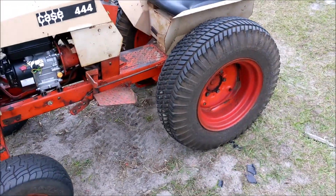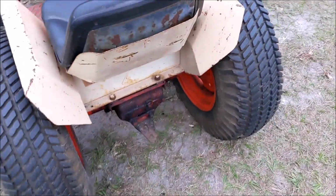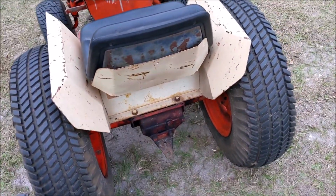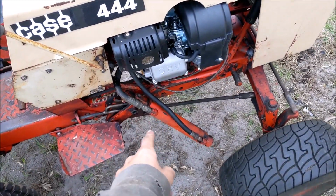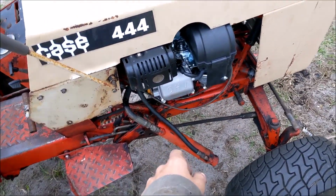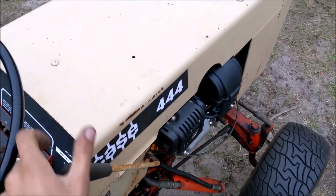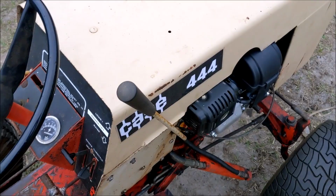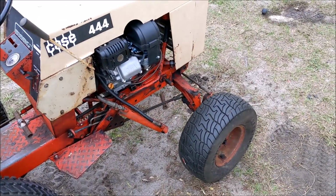Otherwise, that's about it. Next video on this is going to be possibly making a 3-point hitch for the back of this. What I'm going to do is get some new hydraulic hoses and reuse this cylinder and mount that in the back, and then this raise and lower lever will just be used for that. And then that'll be about it on this one.